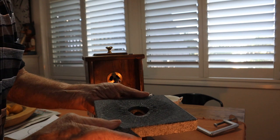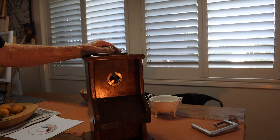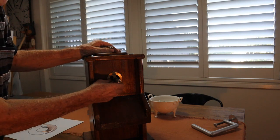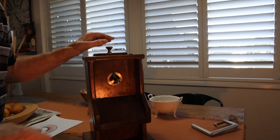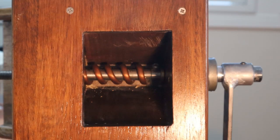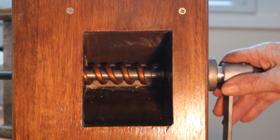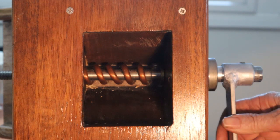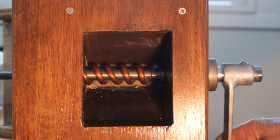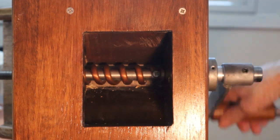And here's the other stone. Now inside there's a bearing — it's just a brass bearing, and this is also where the grain comes through from the feeder. Now inside the hopper you need some way of pushing the grain out towards the stones. So all I've done is wrapped a small copper pipe around the shaft and fixed it to one side. So as you're turning, it pushes all the grain out.